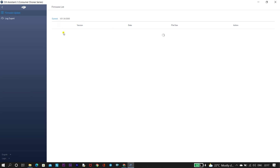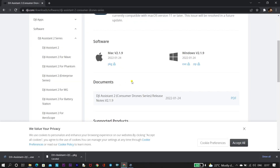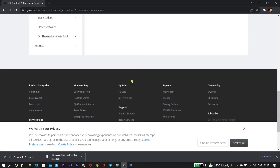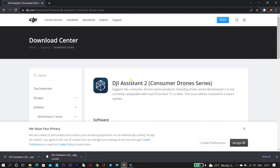After many tries with both DJI Assistant 2 and Drone Hacks, we were not able to downgrade the firmware. When I contacted the DJI support team, they confirmed that downgrading is not possible from version 1.04. The only solution now is to wait for an update from Drone Hacks and see if they can bypass this firmware. Until then, I suggest you do not upgrade your firmware. That's it for this video — if you found it informative, hit the like button and subscribe. See you in the next video.